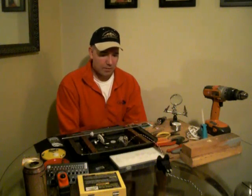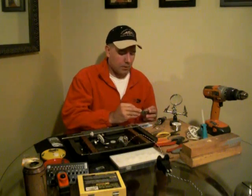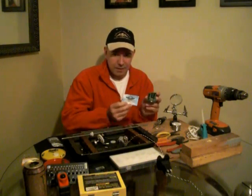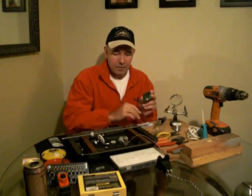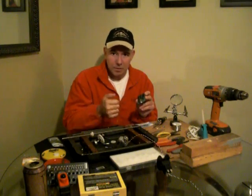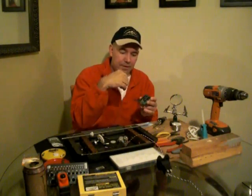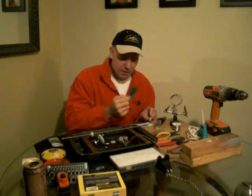Now let's move on to actual soldering and getting the wires onto the potentiometer. I purchased a little board called the 2090 from Desktop Aviator. This is a USB plug-and-play interface device — great little unit. It's the most expensive one they have at $50, but highly recommended because you can hook up analog potentiometers, rotary encoders like the dials on your radios, and single pole single throw momentary push-toggle switches up to 20. It also comes with little terminals that you solder wires onto, which then snap onto this before you plug it into your computer.